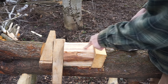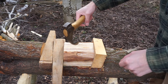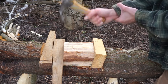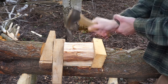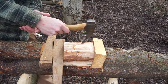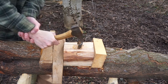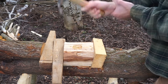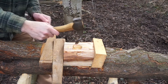We begin with using this tool in line with the grain — the grain is running all the way through and I'm going to start the hollow working in line with that grain with the handle. If I work to the side I'm worried about the wood tearing out unwantedly, so I'm going to begin to work in the middle. I'm raising a few fibres up; the tool is just lifting up and down. As I'm exiting the tool I'm slightly twisting my hand away just to drop it so the edge leaves the wood more easily. Coming back the other way — I've relieved the fibre, which is what we were aiming for. Starting off quite small in the radius in the middle, and as I begin to establish a hollow I can begin to expand it.